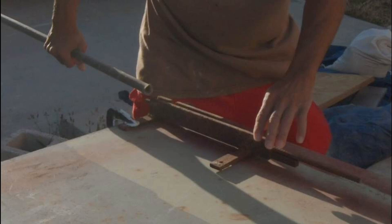Between the two flat bars, in that groove, is a piece of rebar, a piece of steel, and in my right hand is a piece of pipe. The longer the pipe is, the more leverage you have, and the easier it is to bend the steel. It usually takes 5 bends to make a complete stirrup. This piece of steel was about 3 inches short, so I did not get to bend that 5th bend. But pretty much you have the idea. Here goes.